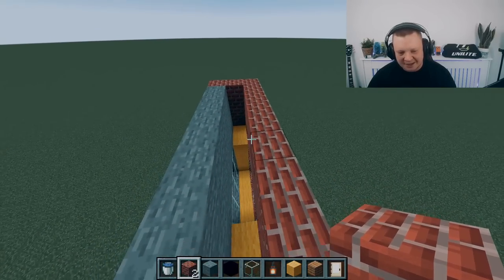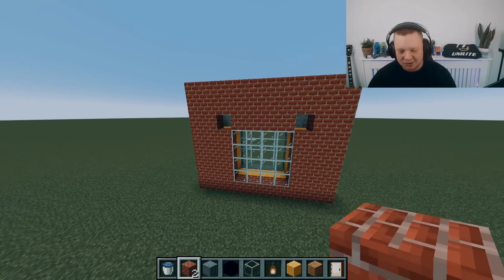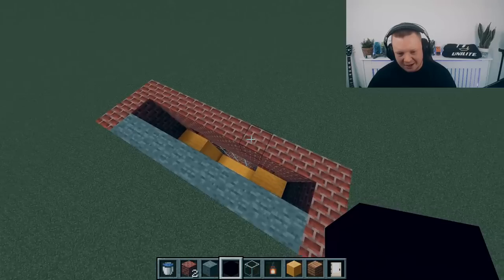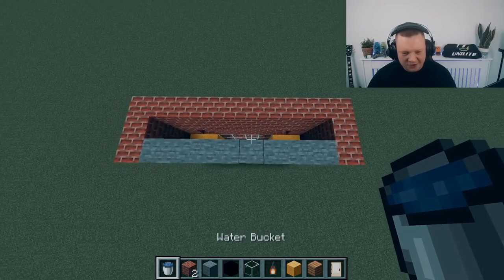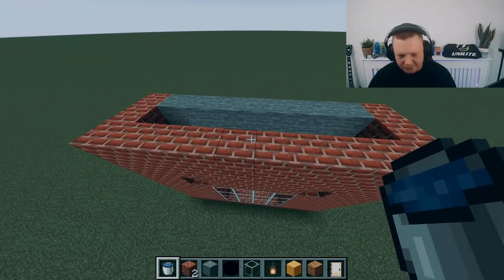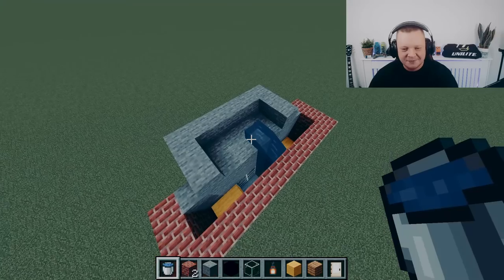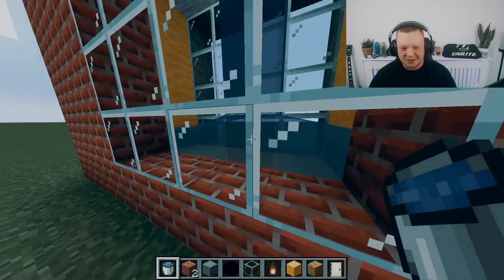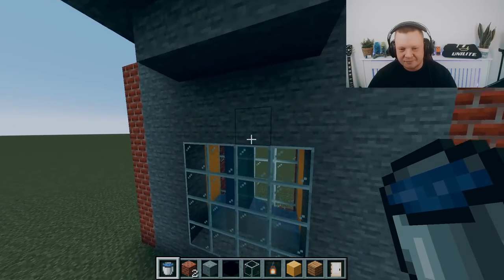How it does that is there's usually a cavity tray installed above the window that collects water. To show you what happens if there wasn't a cavity tray installed — if water gets through the brickwork and into your cavity and you haven't got a cavity tray, then the water is going to come into your house. So you don't want that.